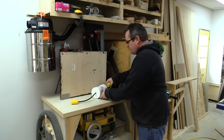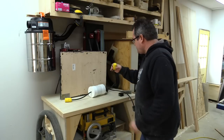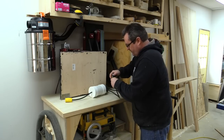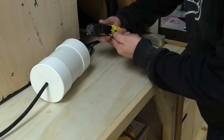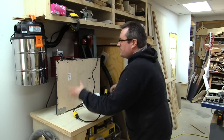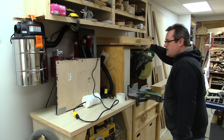I deliberately made these two wires come out the same end so I wouldn't get confused. This one will go to the miter saw and the belt sander or grinder. I'm going to plug in the splitter, then plug in the belt grinder, and the miter saw will plug into the splitter as well. The vacuum gets plugged into this one — it doesn't come on. Now it should come on when I start the saw. And it goes off again.